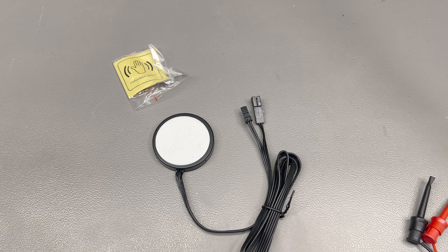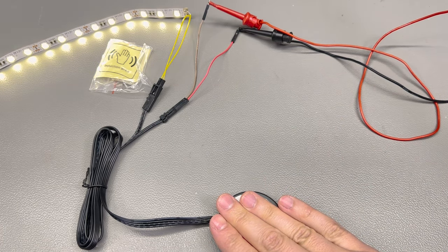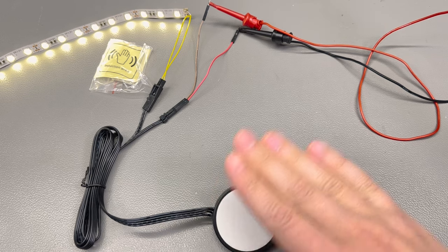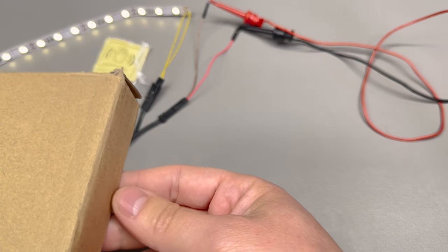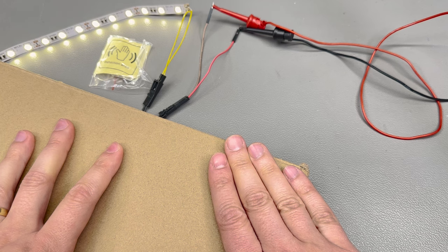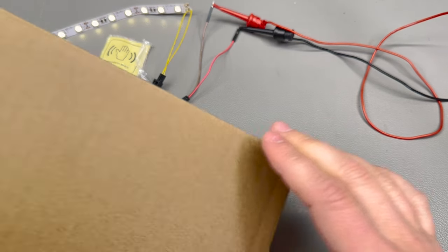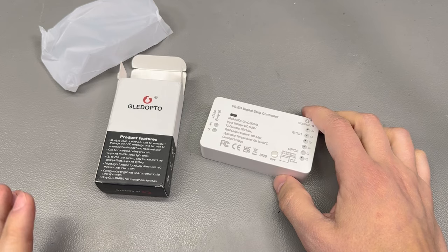It should have the same dimming behavior on a long touch as the previously shown switch. This product also shows some kind of sweep motion sensing. If sensitivity isn't great, you can partially mill out a hole in your wood panel to bring the sensor closer to the surface. Testing it now — it does dim the LEDs by holding my hand there, going up in brightness, then you remove your hand and place it again to go in the down direction. And let's see if it works through a 2 centimeter thick cardboard box — yes, it does work and it dims, so it should also work through a 25 millimeter wood panel.